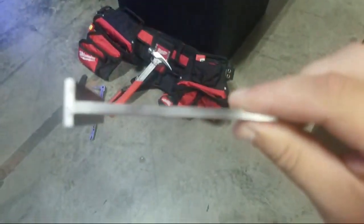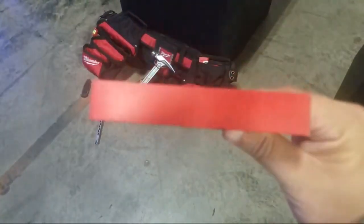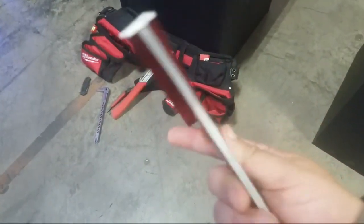And what I mean by messing up a bend is if you're doing multiple bends, so you have like a saddle or an offset, and both of the bends aren't in the same plane, you end up getting off kilter, which means you're not going to be able to fit through the studs.